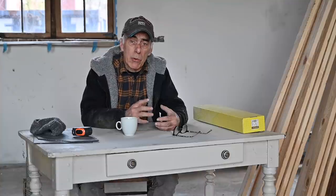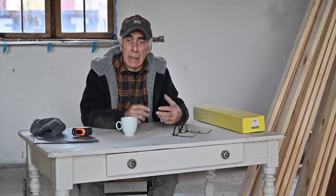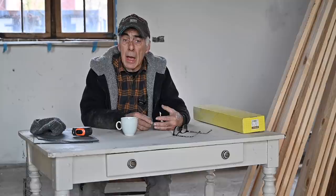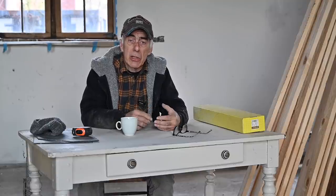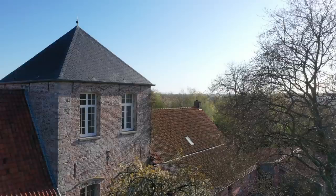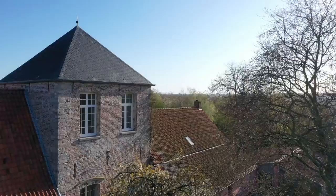You can see all that work on my YouTube channel. That room is as good as ready now. It has a very old oak ceiling that was covered with plaster, so we removed the plaster to expose it, then repaired and sandblasted the old ceiling — it's looking pretty neat. However, I still need insulation, so instead of insulating the roof I'm going to insulate the ceiling of the tower room, or the floor of the attic — that's the purple line in the picture. The second part we're going to insulate is the top of the walls, using different materials.